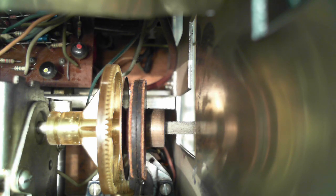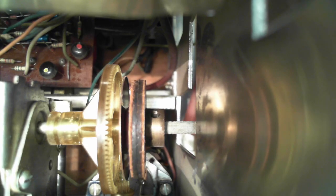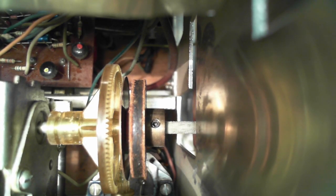Huh. There's nothing whatsoever in the service manual about this. No comments, no diagrams, no nothing. Well, what if the problem is I'm going at this totally backwards? What if the clutch is shifted on the shaft? What if I got this whole thing backwards? It's the clutch. This set screw has come loose and the whole clutch has slid to the right.